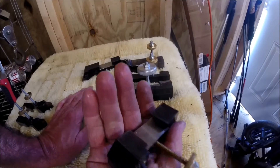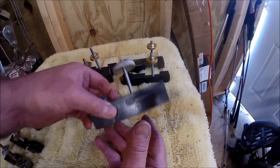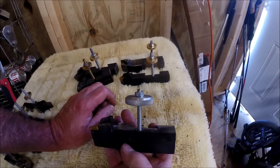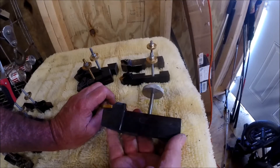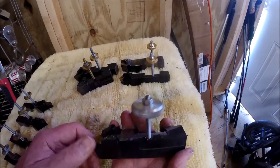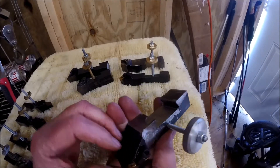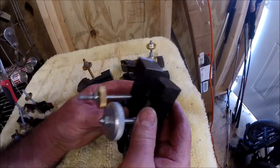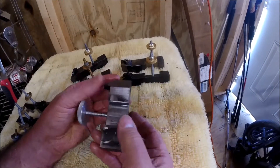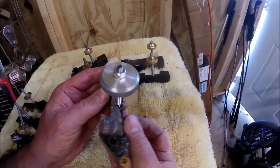You can notice it's been cut off and dovetailed. These are all done for a BXA. This is a DVJLR163, uses the D insert. And you'll notice this is actually an inch and a quarter holder — all the others are inch. This is the one I had a little trouble with in an earlier video where I had to weld it up, so it's been machined a bit more than normal.